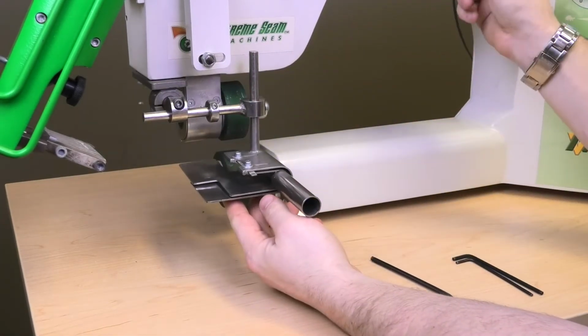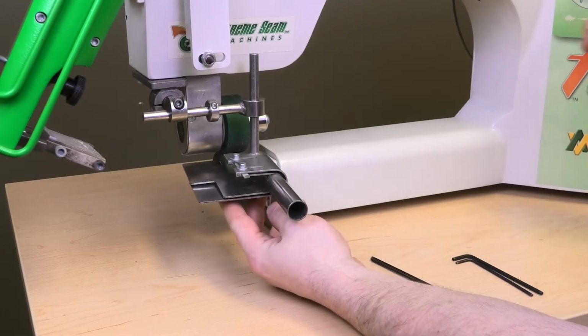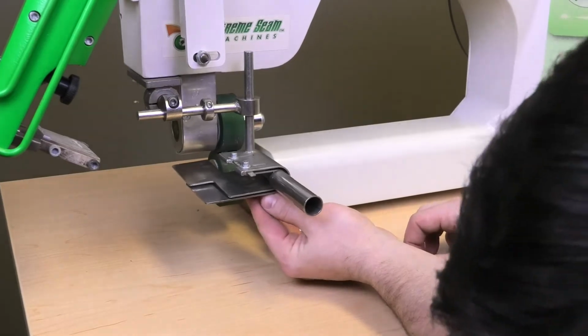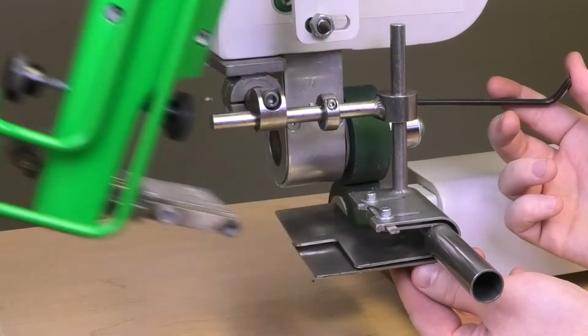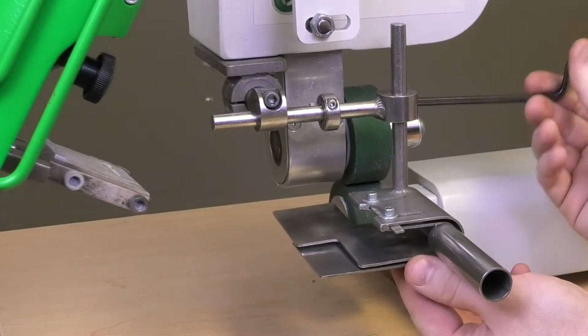And then when lowering the wheels, we're going to turn the speed to 0 and delay all the way up to 10, just so the wheels aren't going to swing in and grab it. And I'm going to get prepared to lock this down. I'm going to look in through the bottom. See how that swings in without hitting? I'm good to lock down this bolt.